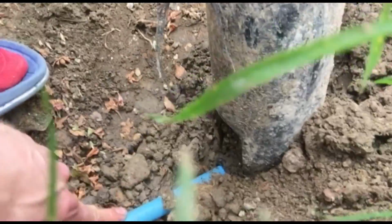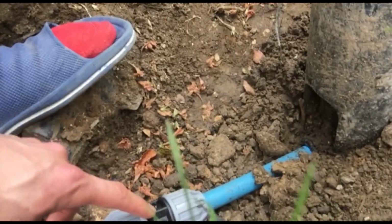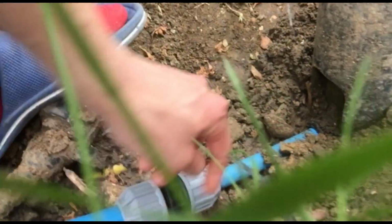Our house originally had a 20mm blue pipe, so I used a reducer coupling unit, going from 25mm to 20mm. With all the connections that I'm showing you, you need to have the appropriate spacer that slots into the blue pipe so that you can compress up against it when you're screwing and fitting it tightly. So this is a 25mm spacer. They're really cheap, I think about 30p. And on the 20mm that I've just pointed at, you need a 20mm spacer.